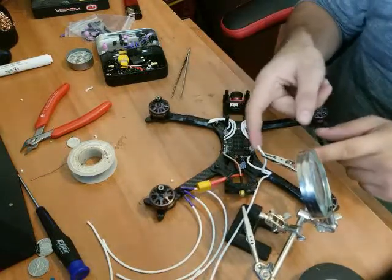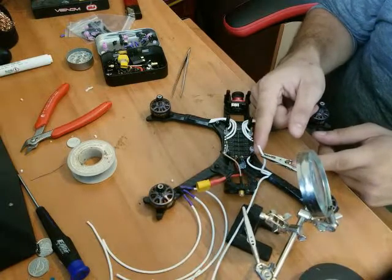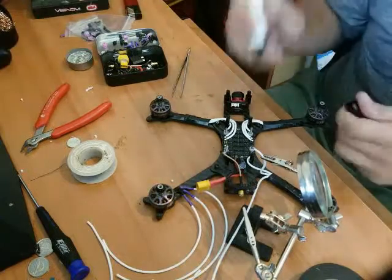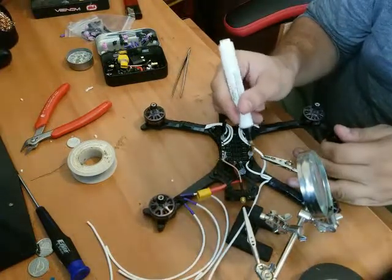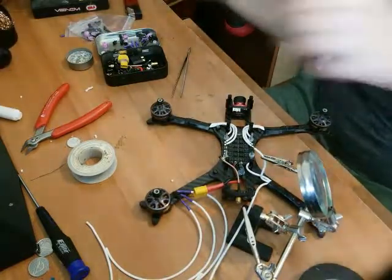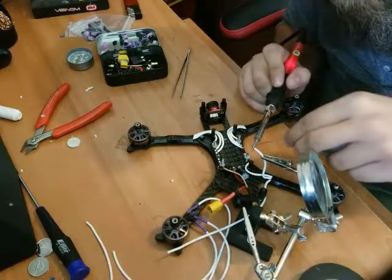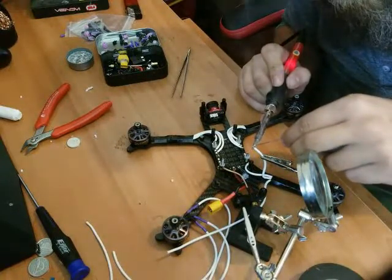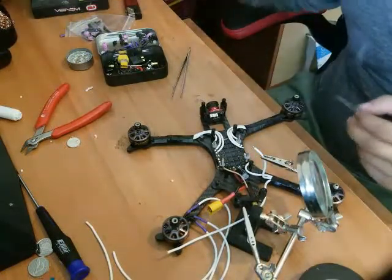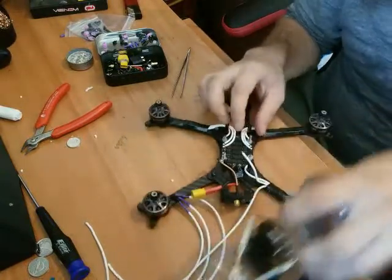I don't want to have the wire pointed up like that, because when I add the solder, I feel like it's going to flow down into the jacketing anyways and make it hard to bend around the tip. Again, bit of flux on the end. Clean the soldering iron tip and just going to add the solder again to the soldering iron. You can slide it right onto the tip. A little bit of that onto the wire, and that is good.